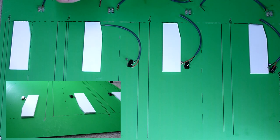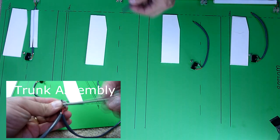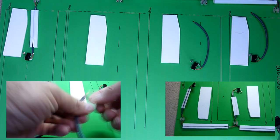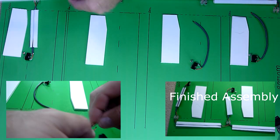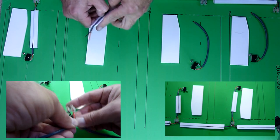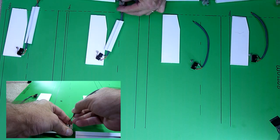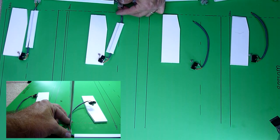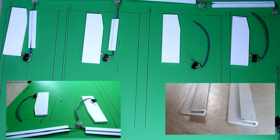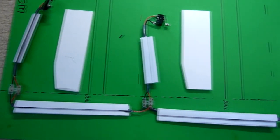Go ahead and solder the line on the switch, and now make the trunk to go along the back. You could use wire caps, but in this case we're going to use 5-amp terminal blocks — we're going to put a terminal block at each drawer level. We're going to run our loop wire down among the terminal blocks, and then plug the switch directly into the terminal block to create the loop that closes when the switch closes. The terminal block keeps everything nice and tight, and you can mount all this ahead of time and set it in the drawer and it holds its shape. Also cut the wire management and put it in place, leaving some gap so you can move the wires around.